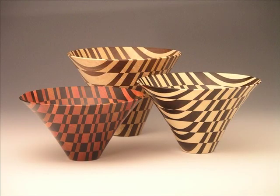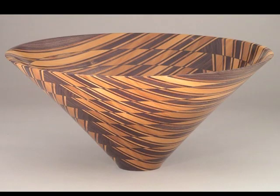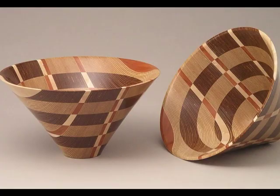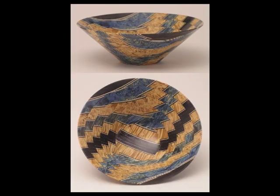It's a clever way to make a bowl from a minimum amount of wood, but more than that, it's a technique that can be modified using laminated material. All these vessels were created using the same stacked angle cut ring technique, the big difference being that the material was laminated before the rings were cut. Now this project here was done with just 3 pen blanks. I did an article a while back. I'll show you the slides.